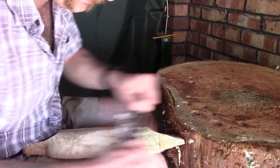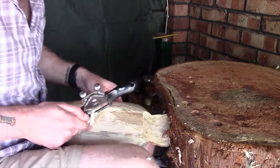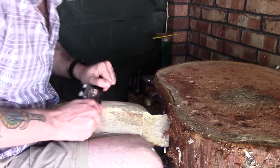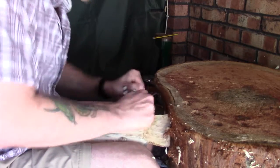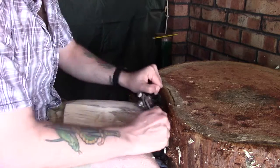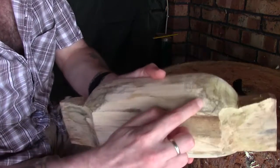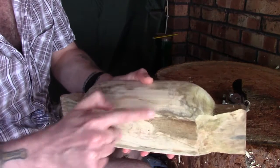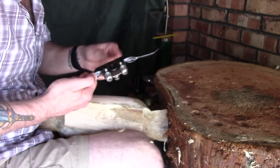When you're done on one side, flip it over and use your other leg as a stop. Then again from maybe two-thirds of the way down — this just makes sure your bowl is nice and even. You can see here I've got a couple of lines where the blade has cut roughly the width of my finger, leaving a little edge or corner on either side. Again, no problem at all, all you need to do is go over it very lightly.